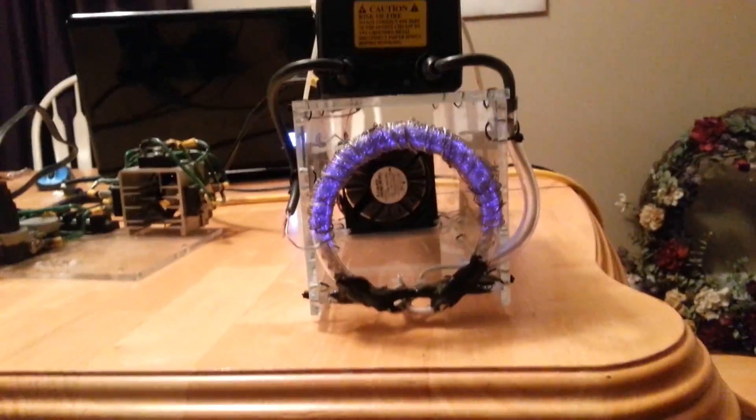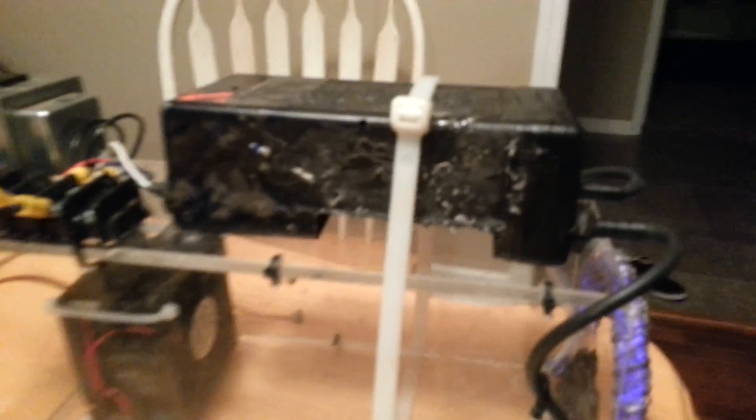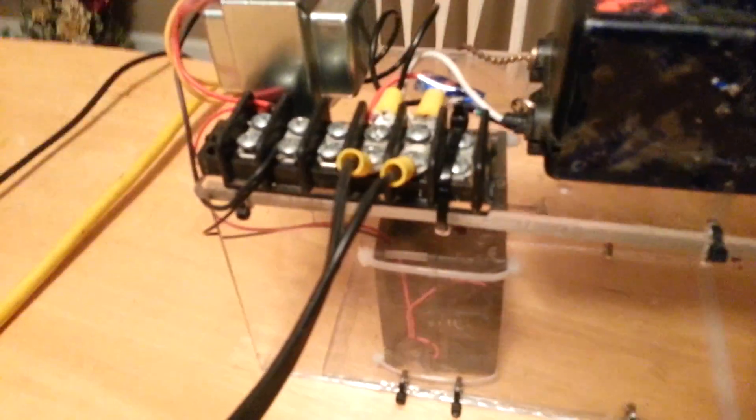This particular model is kicking off quite a bit of gas, and one thing I want to describe to anyone who might decide they want to build one of these is that ozone gas is very corrosive to electrical components. This particular device would eventually fail after a while because the ozone gas will get into the circuitry and corrode some of the contact points. I'm not sure how bad it will do it, but that was one of the things that came up in the research.